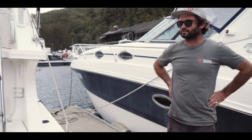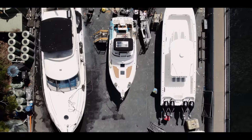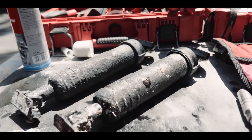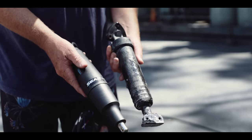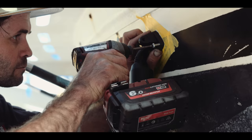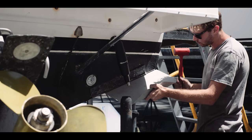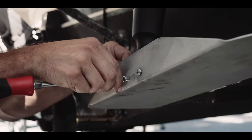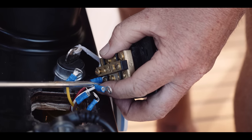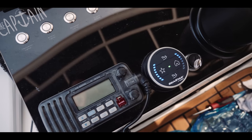The boat is based at Akuna Bay, so we utilized Brad Francis from Francis Marine to do the fit-out. We removed the existing trim tab system and chose to keep the same trim plates, simply changing the actuators — the simplest and easiest option. The brackets that come with the actuators line up exactly with the replacement system, so it was a like-for-like swap. Up at the helm it was just a matter of removing the old rocker switches, enlarging the hole slightly for the dial controller, which covered all the existing holes — no new dash or fiberglass repairs needed.